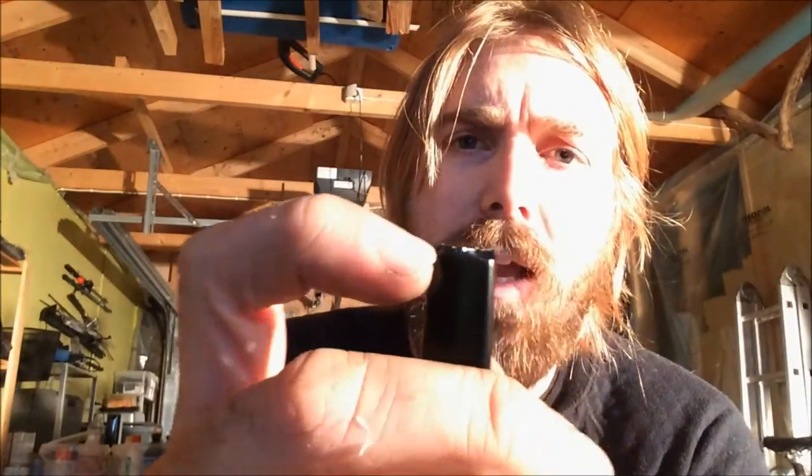As you can see, the handle has a pair of small gaps here. This is to let the handle break at this part and not further in, or even destroy your bike if you fall. This happened to me this summer out on a gravel riding tour — I took a small fall and broke the handle.